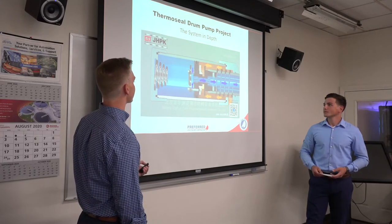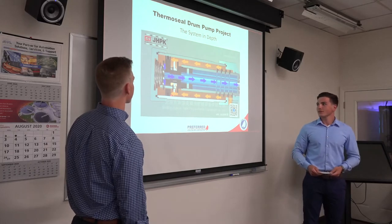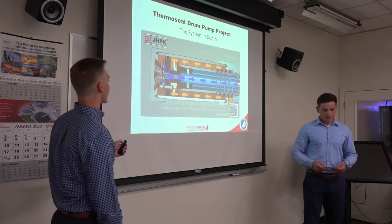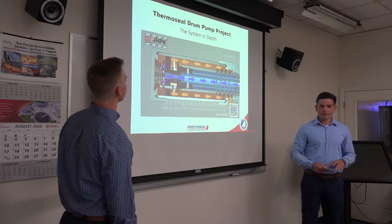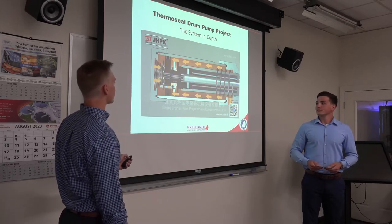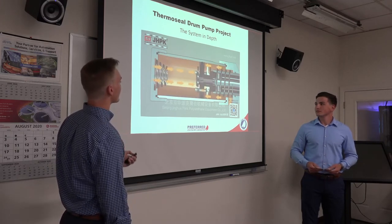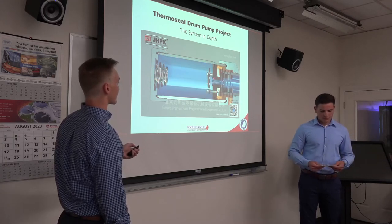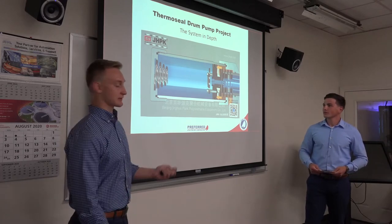As you can see in the video, air comes in this inlet down here and goes up in here and pushes the piston up until it reaches the spring. Once it reaches the spring, this valve opens up and the air is allowed into this portion up here. Then it pushes the piston back down where it reaches this spring down here, which opens the valve the other way, and that creates a reciprocating pneumatic piston.